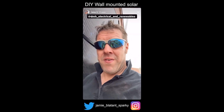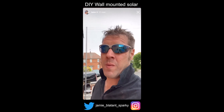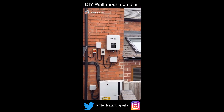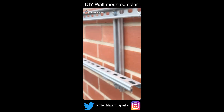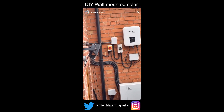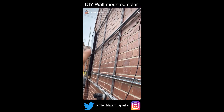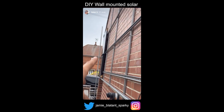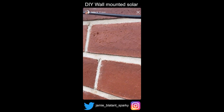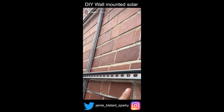Go and follow DMH Electrical — I've picked up a lot just by watching his Instagram. Next tip was from Mark Allison: for MC4s on the inverter, always use the ones that come supplied with the inverter, not ones you bought separately — the panels aren't as fussy. I'm going to connect these dangling legs to my isolator and leave it off. Mark told me to plug in the first panel and see if I've got 50 volts, then add the next panel and check for 100 volts, and so on. That's genius because once panels are up vertically I can't easily access the cabling — so checking as I go is perfect. On the centre panel above the flue I'll break the loop in afterwards to connect the upper panels.